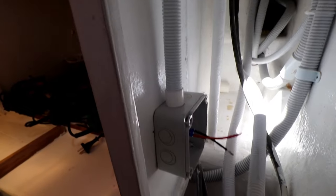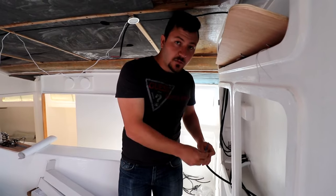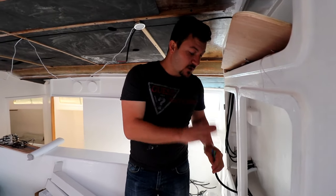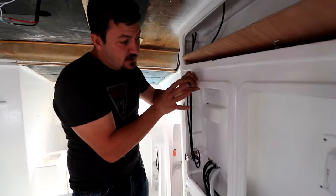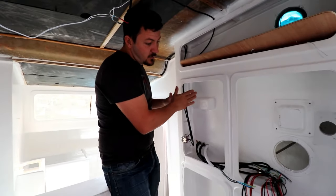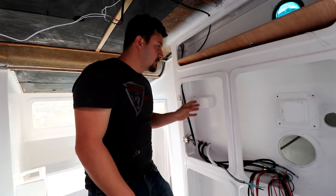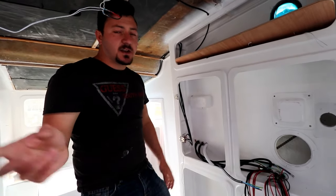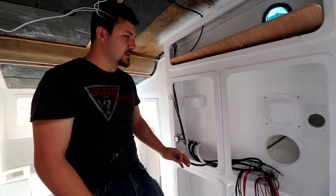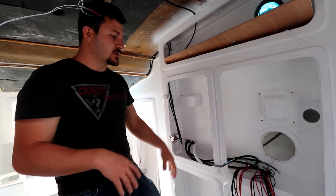We ran it into really thick and expensive conduit with junction boxes wherever we need to separate or reconnect anything. These wires run straight from here to the appliance - there are no breaks, no connections, no joints. I want a solid line from here to there. The reason is I want to be able to turn off each appliance independently directly from the breaker, which can shut down power to any part of the boat running on 220 volts. While sailing, I only want our bridge on - the rest must be off. When we get somewhere with more power supply, we can run the rest.